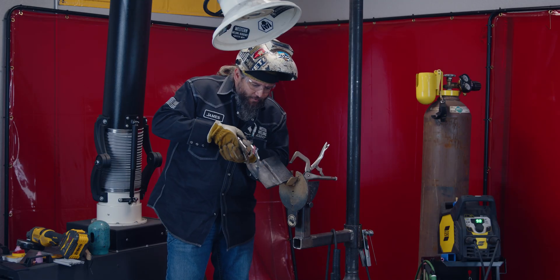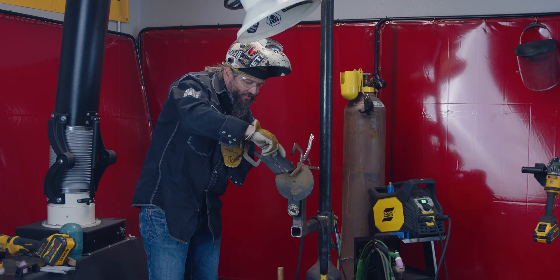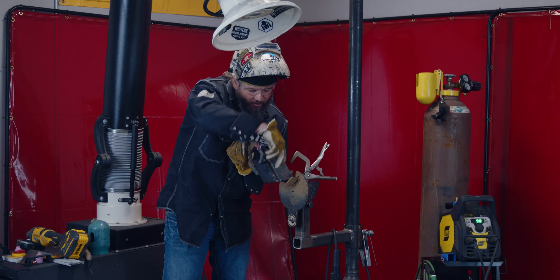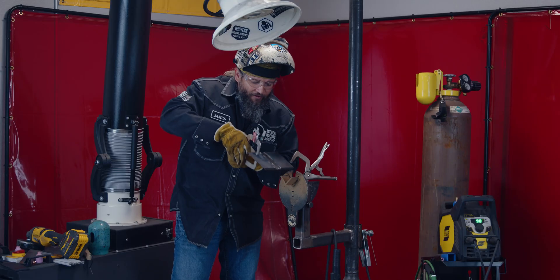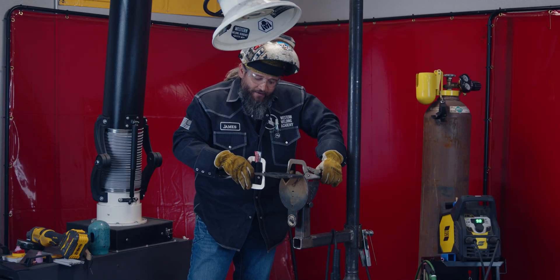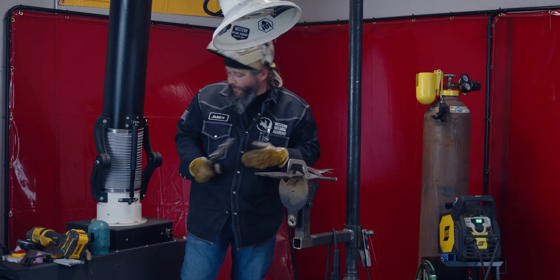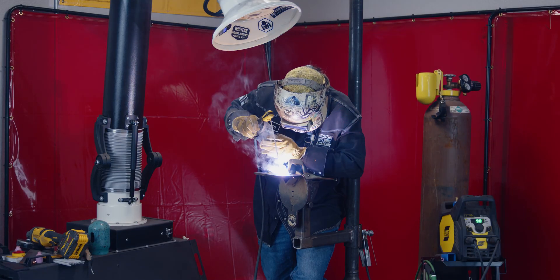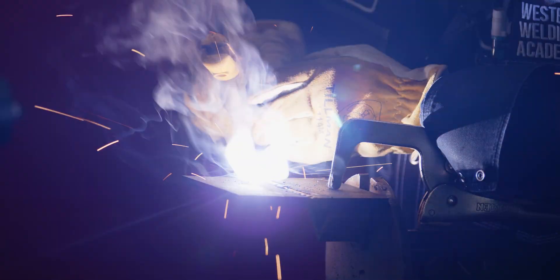We've got one fill pass in, brought it just to the bevel edge on one side. For the next one, I lay the centerline of my rod right on the edge of that weld, bring it right up, and watch my puddle come to the bevel edge on the other side without burning it off. We want to fill this joint up while still keeping those bevel edges there - the bevel edges keep us straight and mean our joint is as narrow as it can possibly be. Hold that end, then break out.